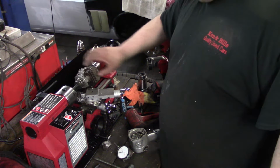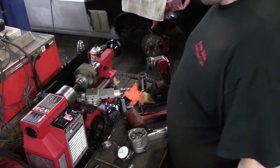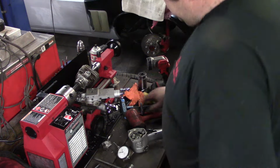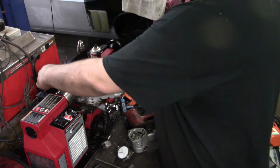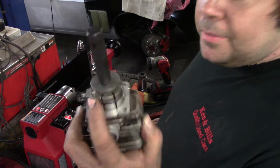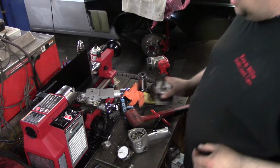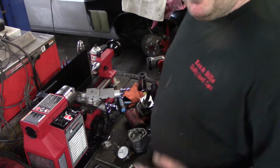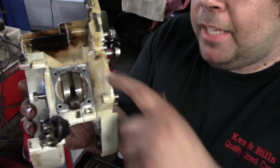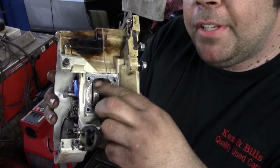Just get this set up in here like this. Obviously, no, that needs indicated in, but I'll show you. Just use this. It can be done. It's a little tricky. You got to kind of pound it in place to get it. But if you want to put an 028 Super 46 millimeter on a 42 millimeter case, you have to grind these out so your piston fits.